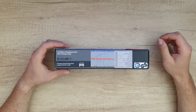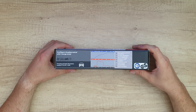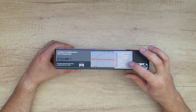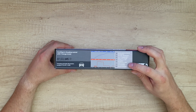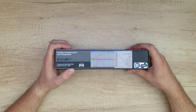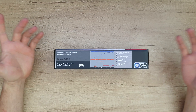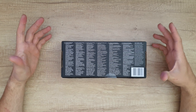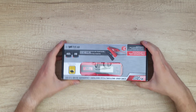Intelligent charging control with seven charge levels: reverse polarity protection and diagnosis, desulfation, start of charging with high current, charging up to 80%, absorption charging up to 100%, trickle charging and monitoring, and demand recharging. Program 3 runs at 14.4V and 5 amps — the older model was 3.8 amps. There's also a winter charging mode for low outside temperatures.